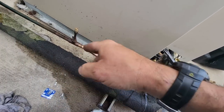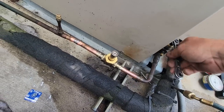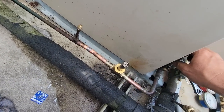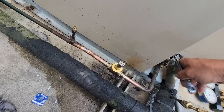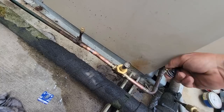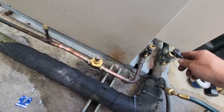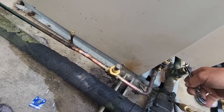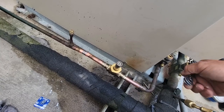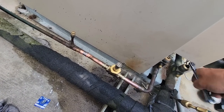So we opened it up, everything here was sealed. Pushed it back to here, moved it this way. Did a pressure test on it with the refrigerant and it's holding. I did have to go over this one again with the regular alloy because I didn't add any flux to that one — I wasn't planning on actually using the silver. The silver fed right through with that, which I was kind of wondering how that would do. I've brazed over top of crappy solder, soft solder, and I haven't tried over top of the 45% stuff — so now I know.